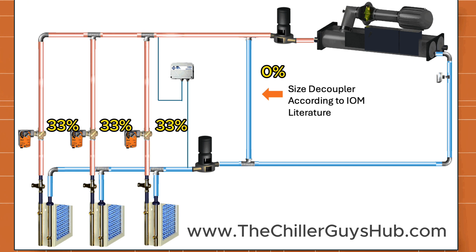In the real world, sometimes you need to add a bypass valve. Contractors will install an actual bypass valve to help control this because of piping arrangements, pressure drop, or because the secondary pump is not sized correctly. Typically the secondary pump needs to be quite a bit larger than the primary pump because there's more restriction in the piping and it has to reach the last unit.